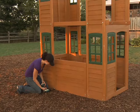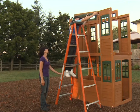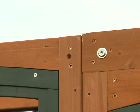the previously installed T-nuts. At the top of the assembly, above the half panel, place the 070 transom panel back between the swing and door wall assemblies so the bolt holes are at the top of the panel.